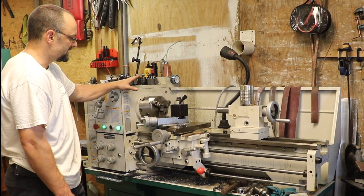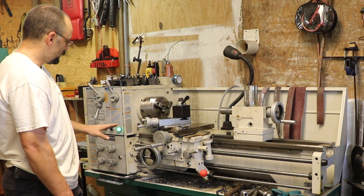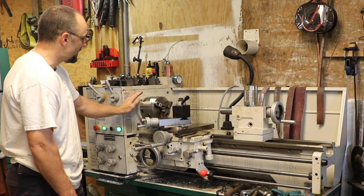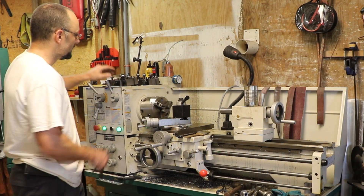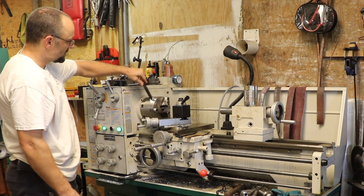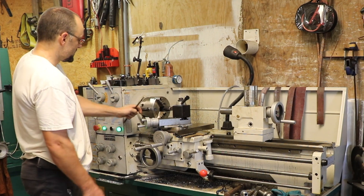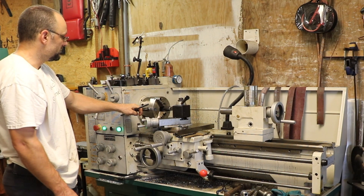The most annoying thing I'm going to address today is something that's not obvious at first. On a real lathe that a machinist would use full-time, they leave room — they curve and extend the headstock out so that your chuck key doesn't interfere with the gearbox or whatever's driving your lathe. On this lathe, I can't spin the chuck key right there. The only place I can spin it is when the chuck key is perfectly vertical. Even if I have it horizontal, there's not room to spin it. And that's really annoying, especially when you're trying to use a four-jaw chuck.